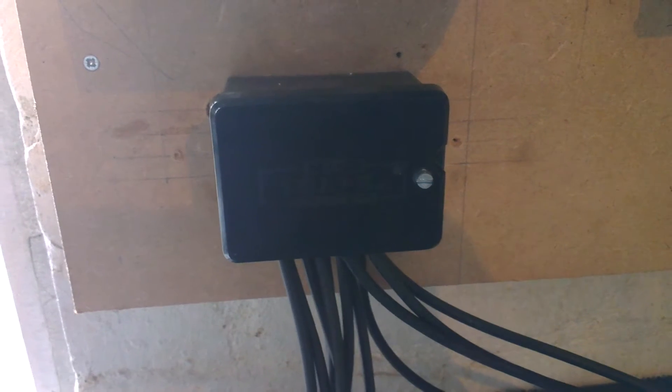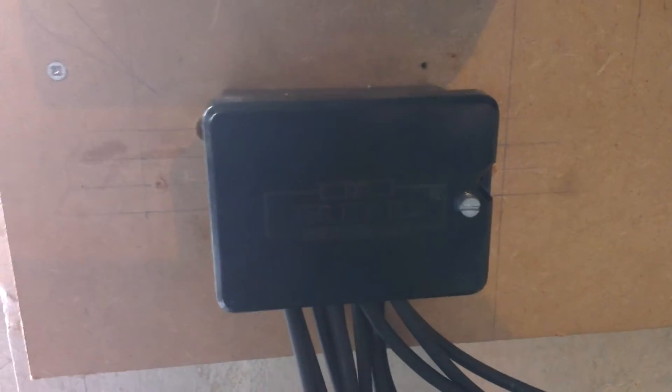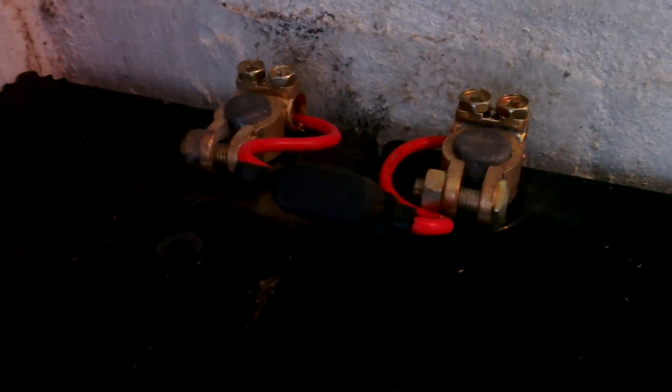The wiring - I've changed the wiring. I've got this industrial connector block which has got two brass bar blocks inside it to wire them all together. You can see that the positives are at the back, all wired into a block, and I've got all the negatives wired into a block at the front inside that unit. These things here I haven't quite finished because I'm waiting for a few more parts, but these have got 7.5 amp fuses in them. All the cables go down here and stop off at the terminal blocks.